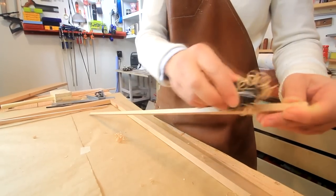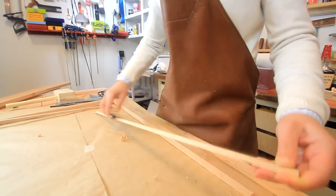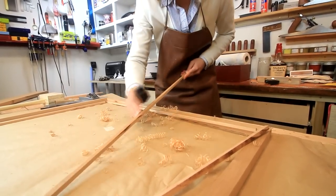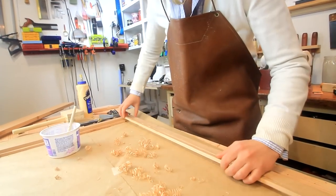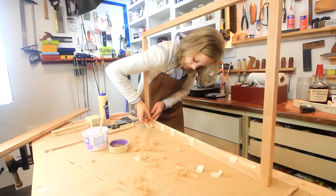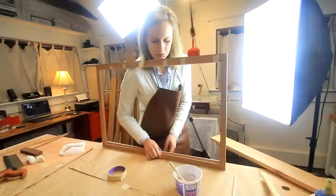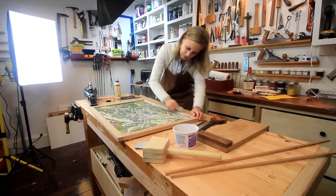To create a smoother edge, I used my new tiny plane and chamfered the edges, leaving a 2 inch space on the end so as to not affect the joint. Then I glued them in place and secured them with masking tape, which works as a clamp. It's a great idea when you need clamping power but have no way to fit a clamp on it. Once it had dried, I sanded everything.